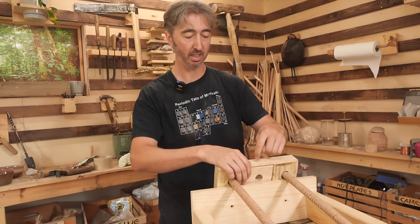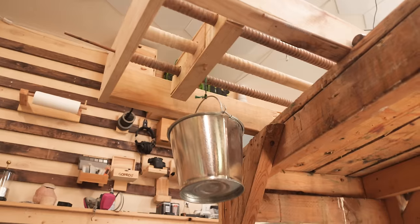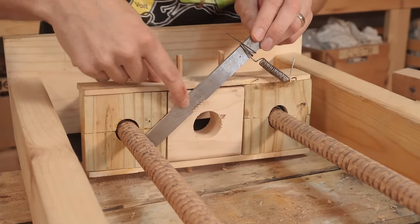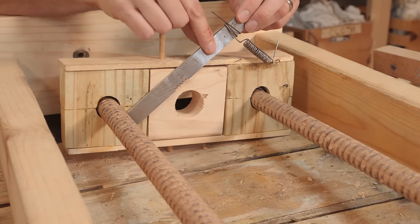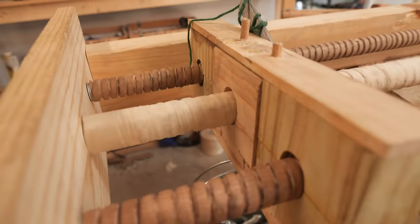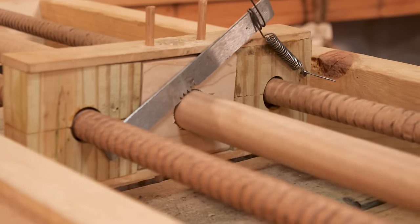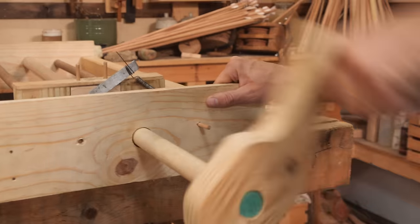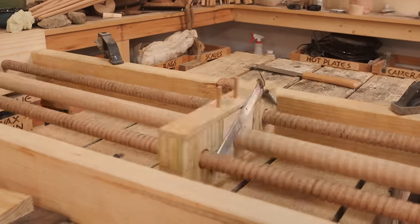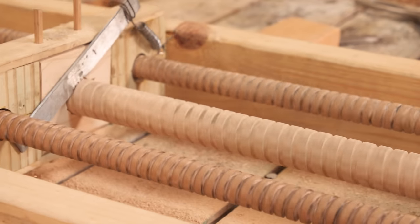I think we've got it going. The only thing left is to put in a center hole and then put in a cutting tool. As for the cutting tool itself, we came up with several different iterations and designs. Ultimately, we cut a few small teeth into it, and it occurred to us that with this cutting tool we can come up with different versions of different widths and cut different widths of threading. After a bit of experimentation, we eventually settled on a saw blade held down with tension from a spring made of our wire. Interestingly, coiled springs were a much later invention — supposedly not invented until almost 300 years after da Vinci. With the adjustable tension, it's now just a process of running the machine back and forth, with the blade bit cutting a little deeper each time, following the exact same path every time.